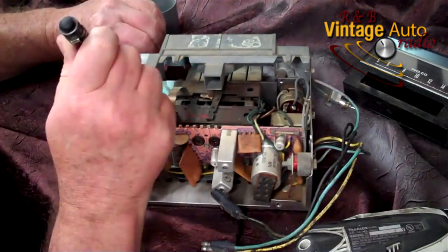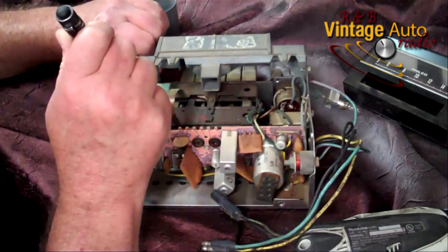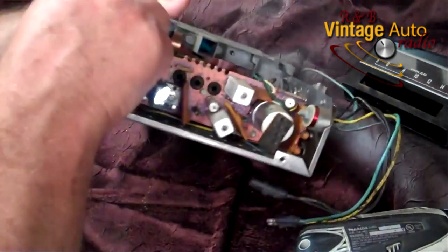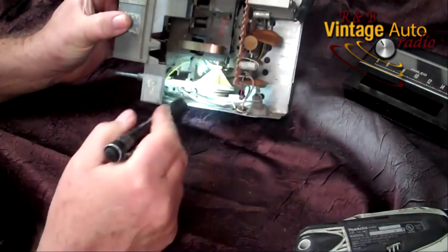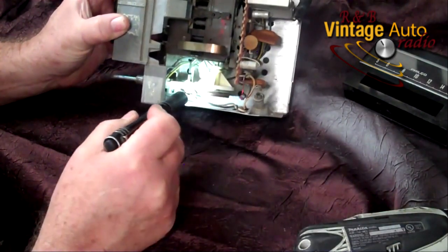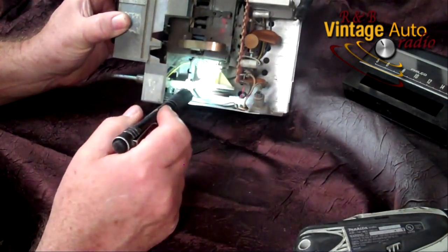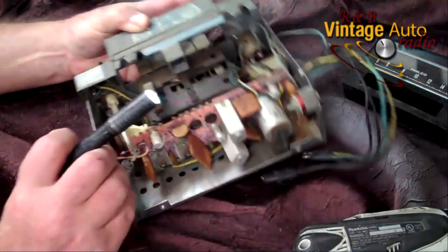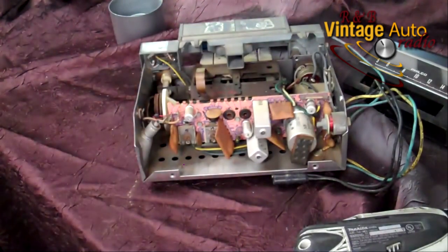All the teeth seem to be on... no, it's missing a bunch of teeth. This is the part that eats up all the time. This is plastic and the teeth right there eat off of it - you can tell that is eat up. It doesn't normally hurt the big gear, but the little one - these are hard to find and replace. I usually have to build some.